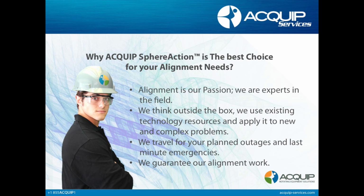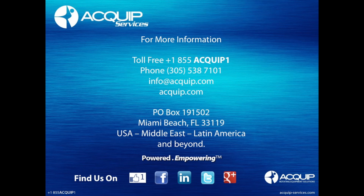You need to identify acceptable alignment tolerances. These alignment tolerances will either come from the machine manufacturer or they will come from coupling manufacturers. You should schedule training to allow personnel to align machines to acceptable alignment standards. Finally, all alignment should be documented.